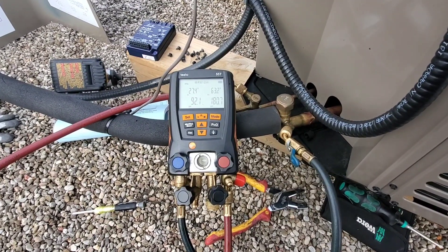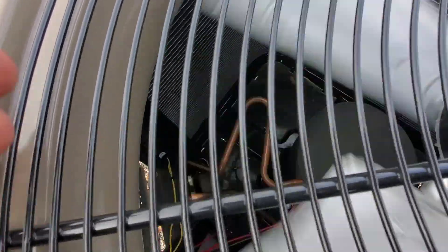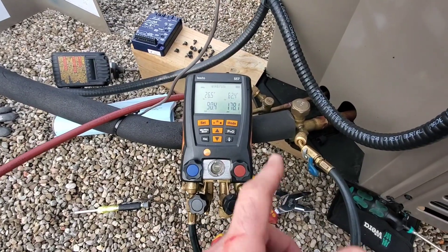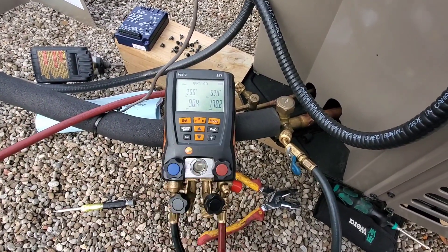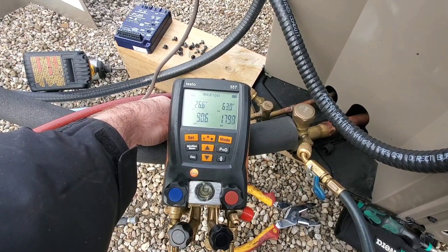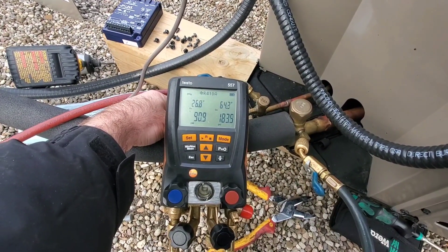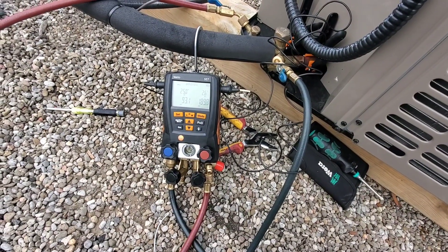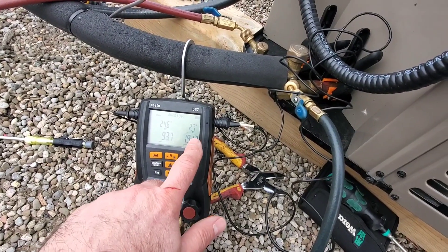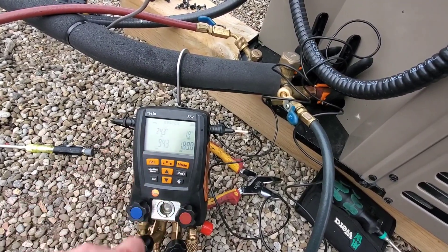I've taken the sensor right off the coil and it's just dangling inside the cabinet — not touching the liquid line, not touching the condenser, nothing. We've settled down and we're maintaining a saturation temp of just above 25°F. Now I'm going to check superheat and subcooling because there could also be a low charge issue here. The liquid line feels warmer than 62°F just from my hands, so I'm not sure if we have any subcooling — if we have no subcooling, we could be undercharged.